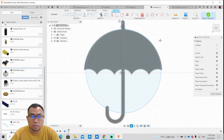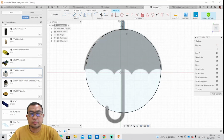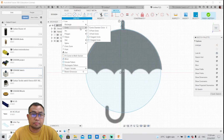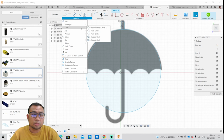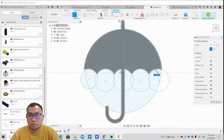Okay, so that means if you are using a JPEG file, it has to be black and white. Okay, so it has that contrast between the cut boundary and the non-cut boundary. If you have a DXF file, you have that line, it's very clear cut, it has no margin for error, and the work later on will be much easier, cleaner, neater.